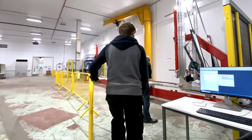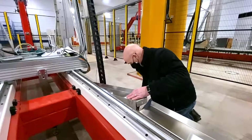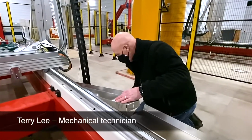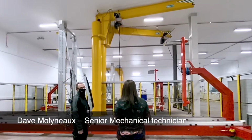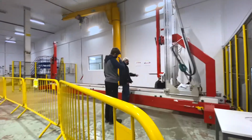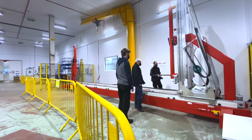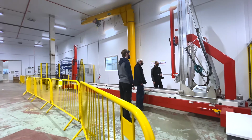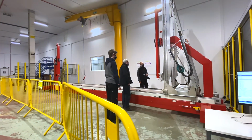There's a dedicated crane for each winding machine, and the winding machines have just had their survey to align them. This is important for the operation of the winding head around the APA frames. The control system for the winders is being commissioned. You can see the team here commissioning winder machine 1. And this comprises a key new safety aspect, which is a light curtain sensing system, which will prevent personnel getting close to an operating winding machine.